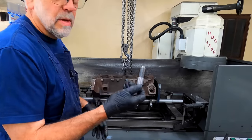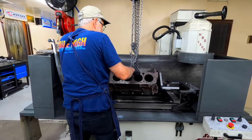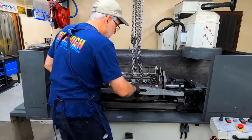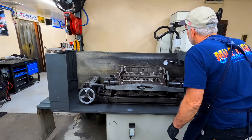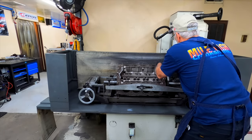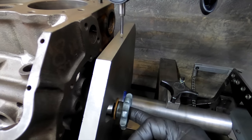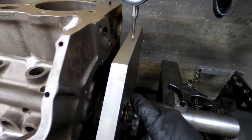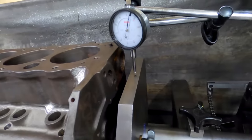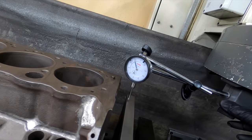We have these little things that go in the head bolt holes. Tighten that up. Put your indicator up, put the cutter wheel down. You can adjust it on the wheel so you get a nice big sweep across this flat plate. From the center here to the center here, up to here is the 90 degree. Once this plate is tightened up nice and tight, then we can indicate the plate in.